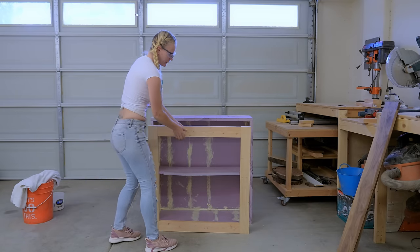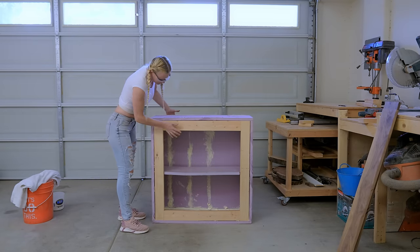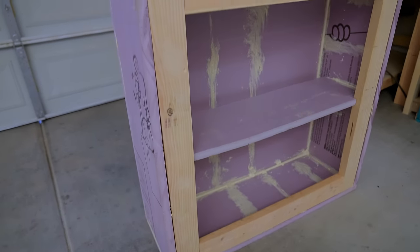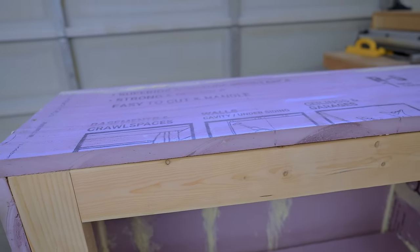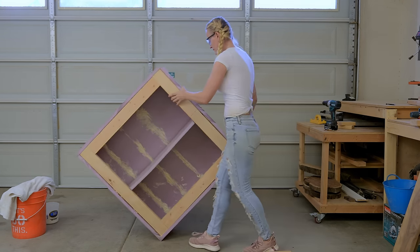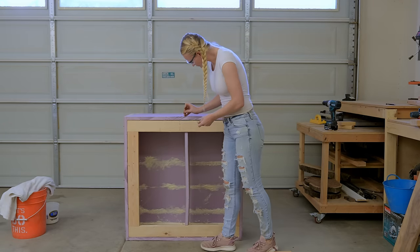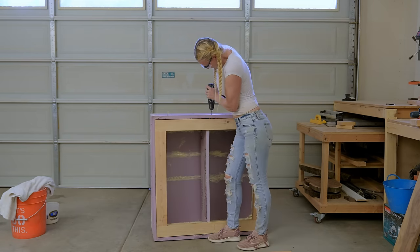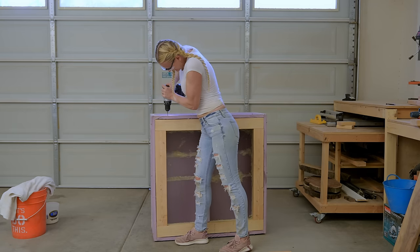And this is how the piece will sit in the box. Now the table can be placed securely onto the legs that I will build at a later point. But before, let's make sure to secure the frame to the box. The screws will poke right through the insulation and screw into the wood. Make sure you let the screw stick out a bit. Once you apply the concrete, the screw head will be covered with concrete and therefore hold the wood in place.